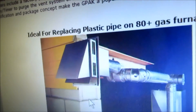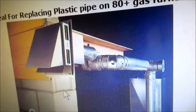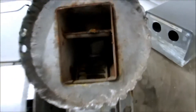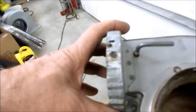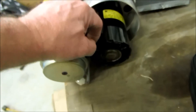All right guys, that's usually what you're looking at — the termination going outside and then the power vent is usually right inside up against the ceiling. We do the joist type of thing. This is the inlet and that's the outlet. Usually there's a hood right on the outside of the house and it just dumps right outside. You can see in this little motor there's a little loop — that's there to oil the motors. Most guys don't do that, but they should be oiled.